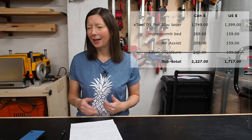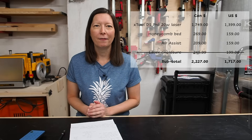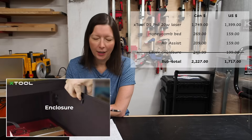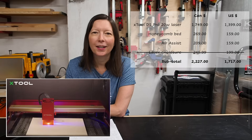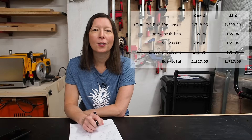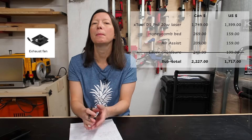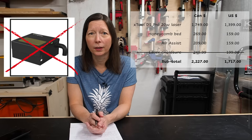But there's more than that. You need some sort of enclosure and a fan to control the exhaust and the fumes, especially if you're doing that in your basement. You can't just run a laser without any sort of exhaust. I decided to buy the X-Tool laser enclosure — it was $245 — but I ended up returning it after one usage. I could tell it wouldn't work; it wasn't containing the fumes at all. I could still smell. The exhaust fan was really not strong enough — it's this tiny three-inch fan that barely blows anything at all. So I ended up returning the X-Tool enclosure.